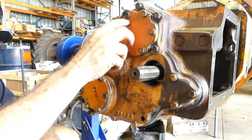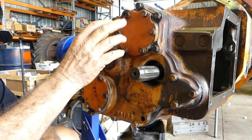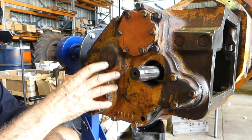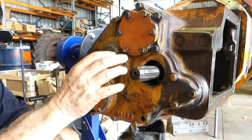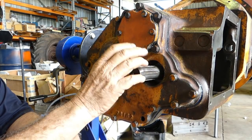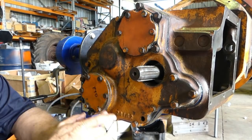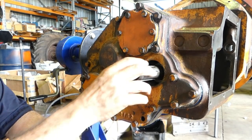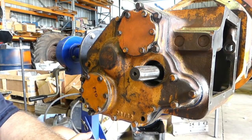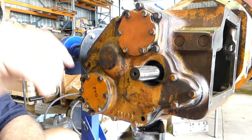But yeah, I've never ever done one that I haven't had to shim, but I think because we built one gearbox out of three, some of the other gearboxes had been hot, and the gears had gone soft. So we had to pick the hard shafts and all the good bits. So that's worked out nicely. It's a bit lucky. I was a bit nervous. I was checking and rechecking everything, but I'm really comfortable now.